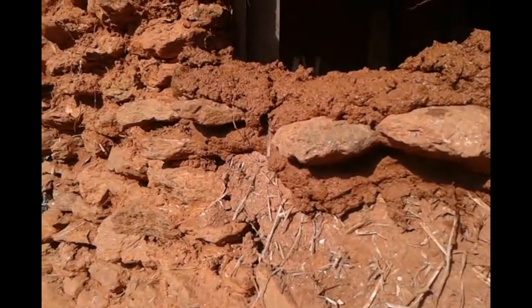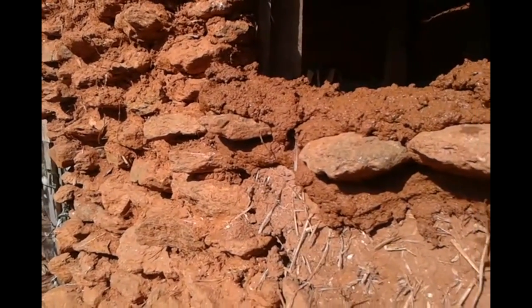You see how I put the rock directly under the nails. I just put a nice little layer of cob mortar right underneath there and I'll mortar that up. Spider I killed accidentally — I'm glad I didn't see it when I was killing it. But you see how I'm staggering the rocks now and moving along, trying to keep them level all the way across there, tying them all together.